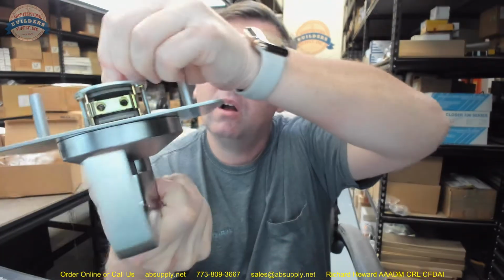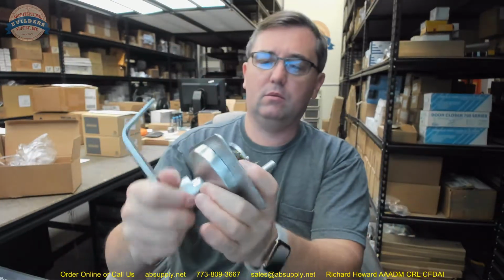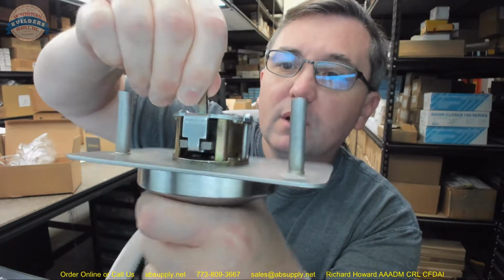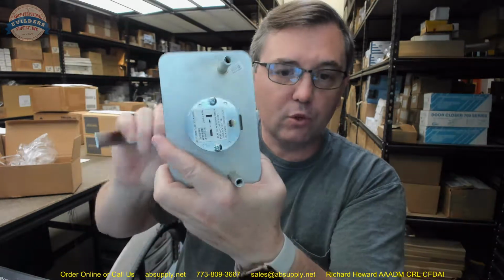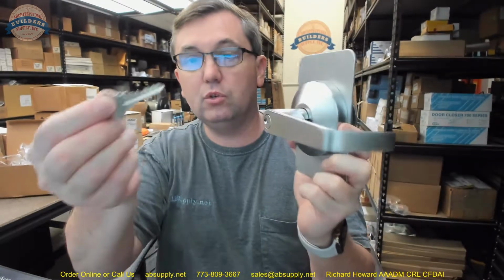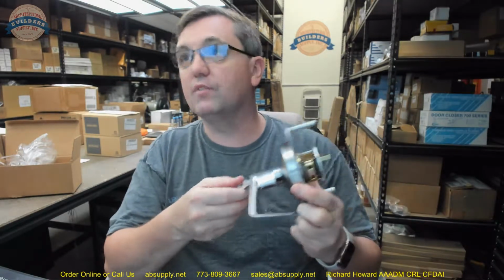There are little gears on the inside that you can see when we pull that up, and that will just sit down into its place. You make sure that when you rotate it, it actually works. It did seat back to where it was. And there you go. So I've rekeyed this lock to a customer's key, which is a service, of course, that we offer. The client needed it keyed to their existing key.